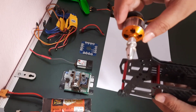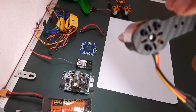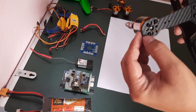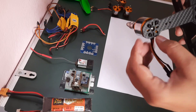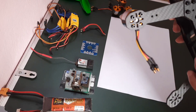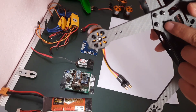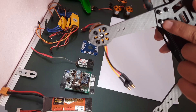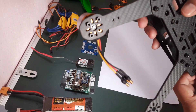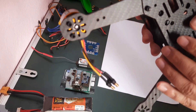You can see I have mounted the motor — the standard fittings of the 22-12 actually work on this frame. I always use 3 bolts; I do not go ahead with 4 bolts, I find it redundant, it just adds to the weight. Similarly, these arms are bolted to the main structure. There are 4 bolts provided with nylock nuts — these nuts prevent unscrewing because of the nylon ring in the nut.